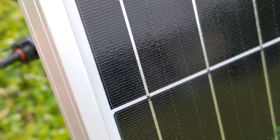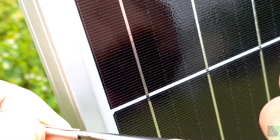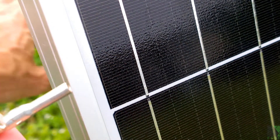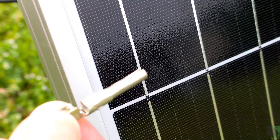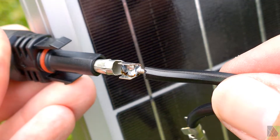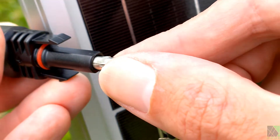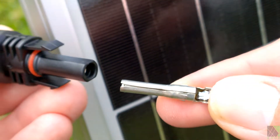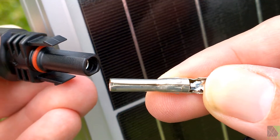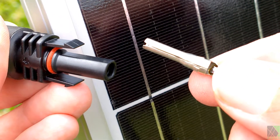Okay, it's not quite enough, so I'm going to split it some more. Let's try it again — much better! Yeah, much better connection now. It doesn't take much to make a difference. That's way better, and you can see how much I had to spread that to get it to fit. Ideally you would do this while the connector is outside of the plastic enclosure, but unfortunately that isn't always possible.